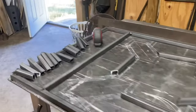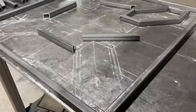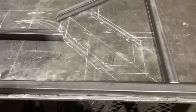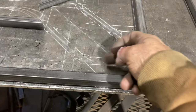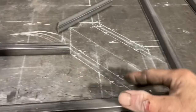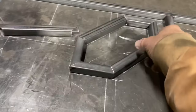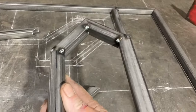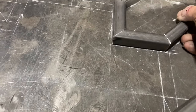I've been cutting some of the stuff out — a bunch of pieces over here, pieces here, pieces there. But I noticed when I started trying to put some stuff together that some of my drawing is off. This was one of the main ones — it's hard to see in the picture but this side's actually longer than this side, and it shouldn't be like that. So what I did was try to come up with a different way of putting it together. Instead of redrawing, I'm trying to put these together just by tacking them up, and then I'll get those put together and buff those welds out, then start fitting them in and see where it goes in that corner.